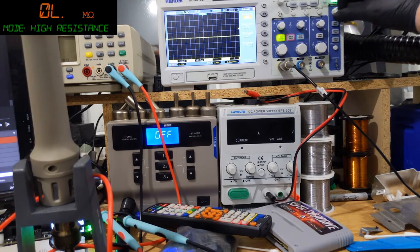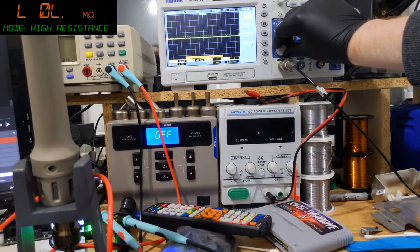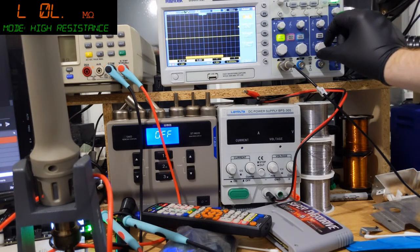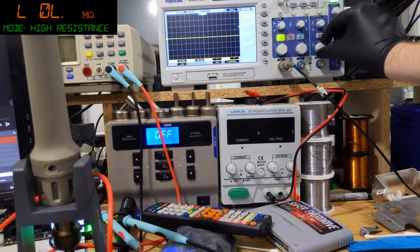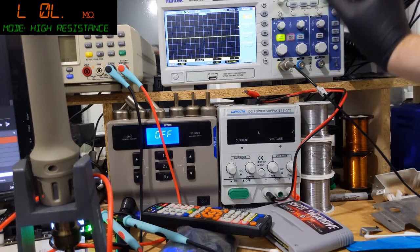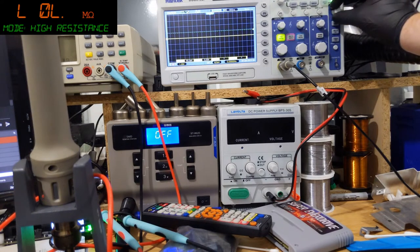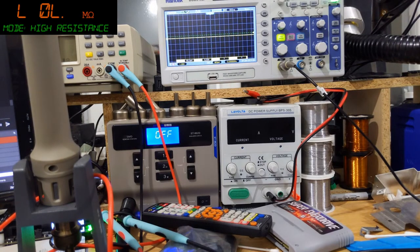So what I'm going to do is set the trigger level to edge. We'll set it to 1 volt per division. We'll put the horizontal time at about, I kind of want it at 500 nanoseconds. I guess 800 should do it. We'll close that auto set menu. The trigger, we'll have it at about 200 or so. Like that.